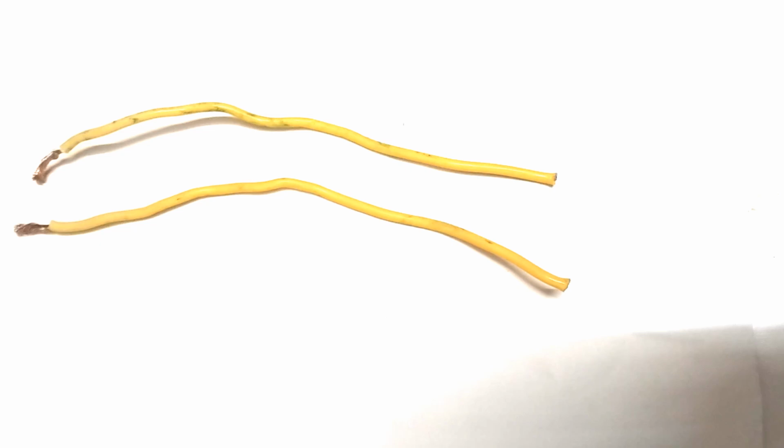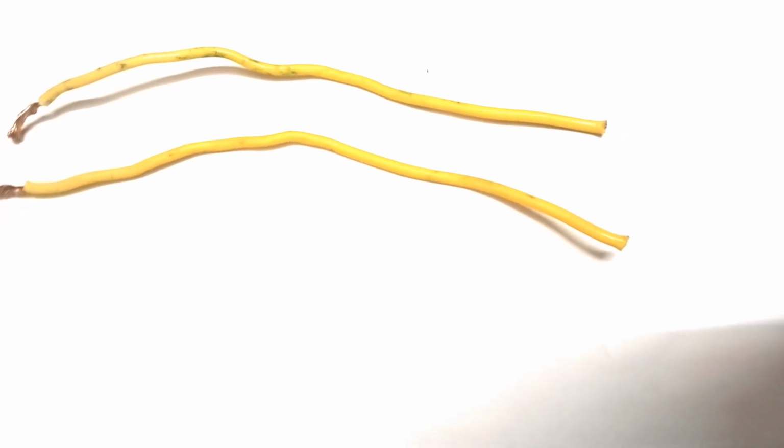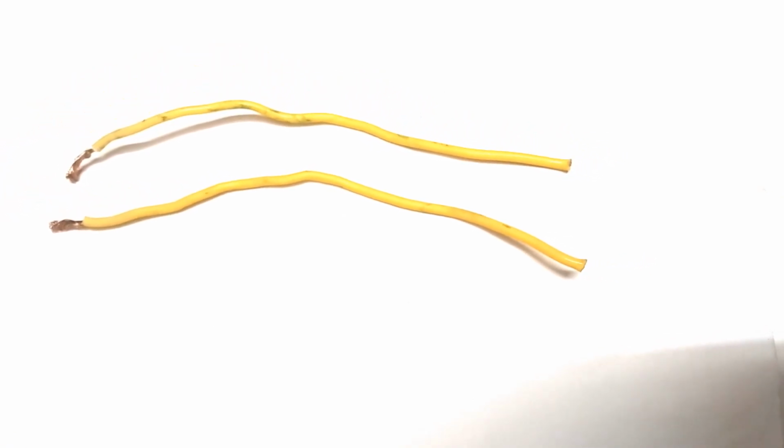Then I have to remove the insulation from the end of the coil and separate the antenna elements. After this, I have to trim the antenna element, clean the contacts and then reattach to the coil. As the terrace becomes quite hot in the bright sunlight, I can't work too long in this process.